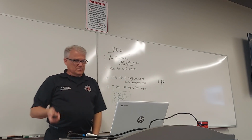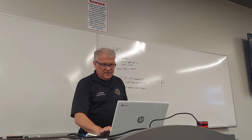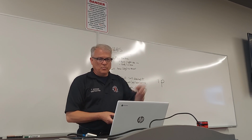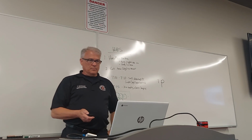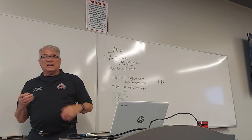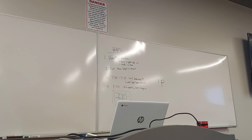Right, I think I have a picture at the end. Fire pump right here. Different sizes for different building sizes. Okay, we have a small one here, which I will show you at some point. Fire department connections. Obviously, we know that the standard is a Siamese. 2 males go to feed the Siamese. There's a clapper valve, so you can feed one side at a time. Goes into the building and feeds the system.